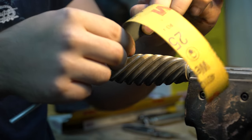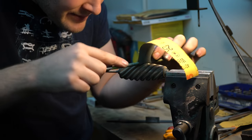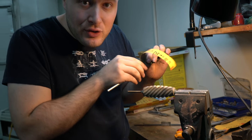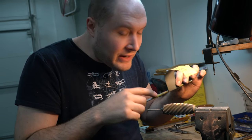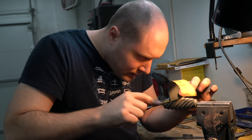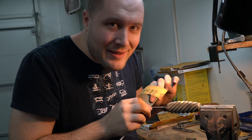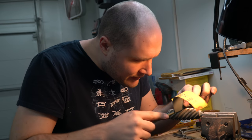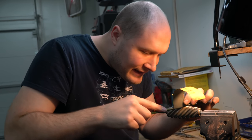Once my paper gets filled up a little bit I just roll the paper over to a clean spot and do it some more. Normally by the time I have the graphite sanded off completely it's sanded all the previous grit scratches off too. It takes a whole lot of sanding. Each grit's been taking me somewhere around two hours or so, with probably a little more time on the final grits just to make sure I don't miss anything.